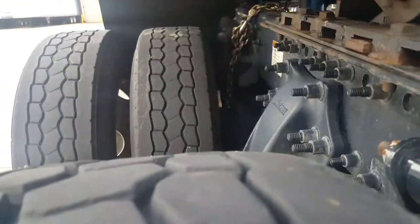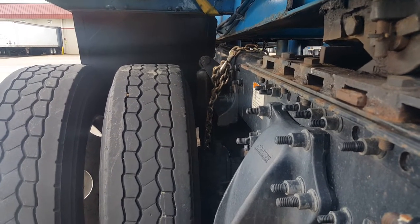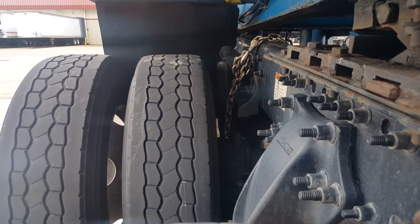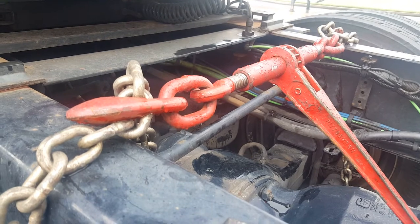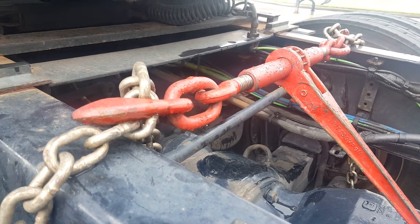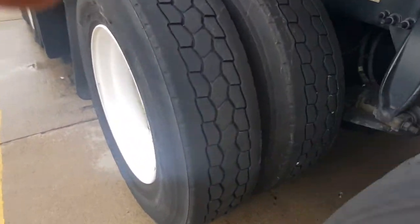If you can see, I do the exact same thing on the back axle. The only thing I don't do on that back axle is I don't use a ratchet binder — I only use that for the front end, because this end tends to be lower on the ground. On the back end I just go around the frame.